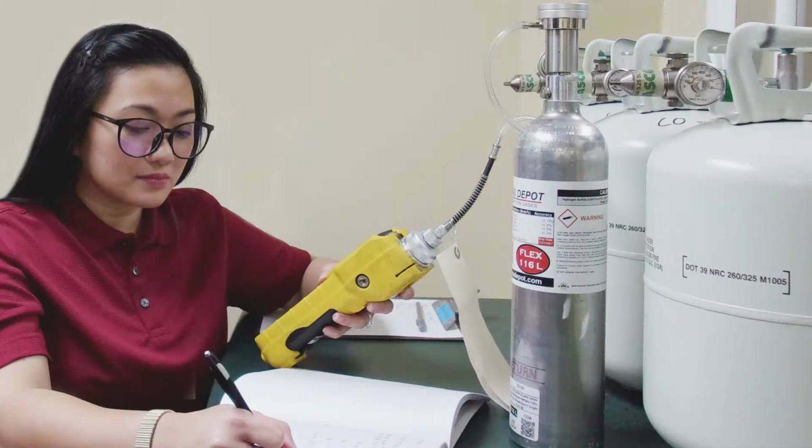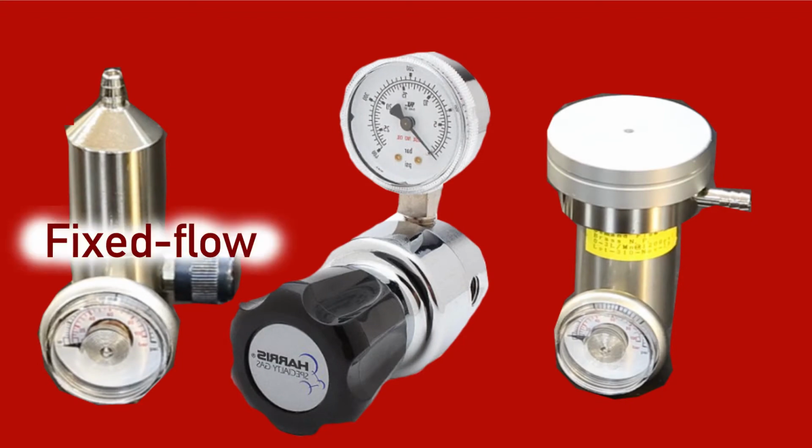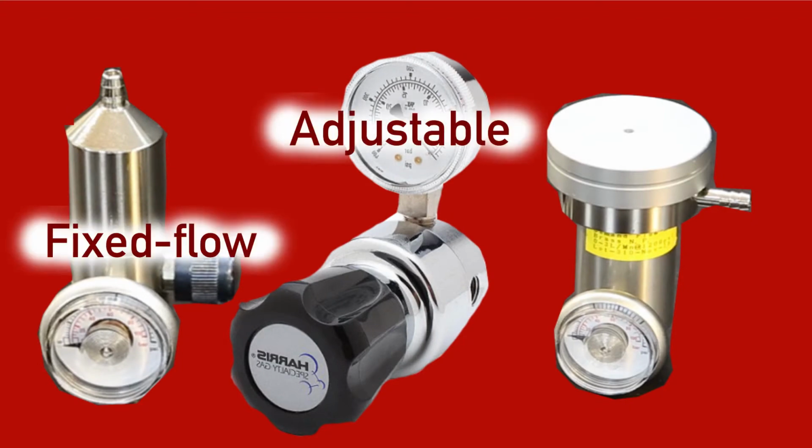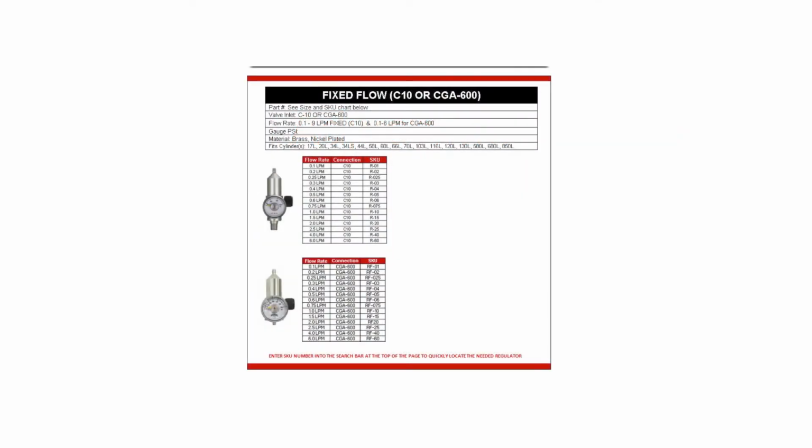The regulator controls the amount of gas coming out of the bottle when performing a bump test to calibrate your gas meter. There are various types of regulators. Some are fixed flow, some are adjustable flow, and some are demand flow. With fixed flow regulators, the regulator is set to a certain liters per minute, LPM. So if you have it set to 0.5 LPM, that is the flow of the gas coming out per minute.